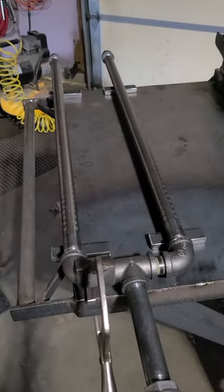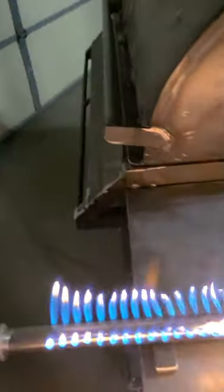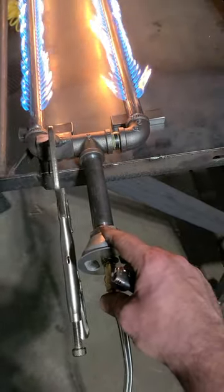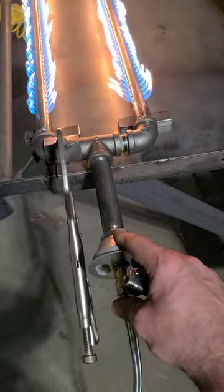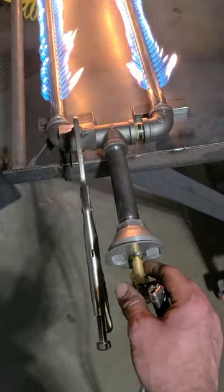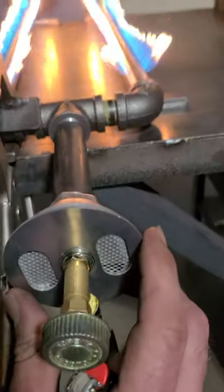And now for the test to show you the goods. Tank's doing fine. I'm running at 7 PSI. I did drill the inside of the orifice — I think it was like a number 45, and I drilled it up to about a 60, which is gauge wire 60. I don't know what that would be mathematically, but it was a really small bit. I had to give it a little bit more gas per air ratio, and my air is almost closed all the way.